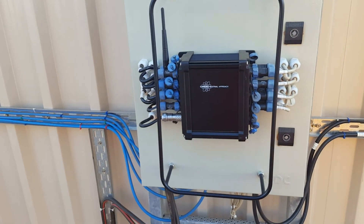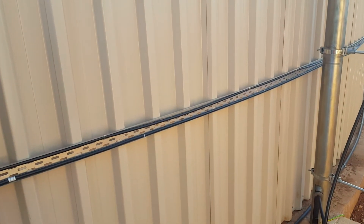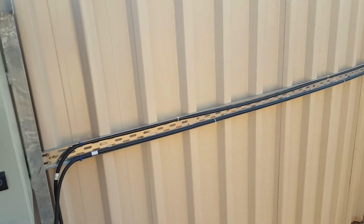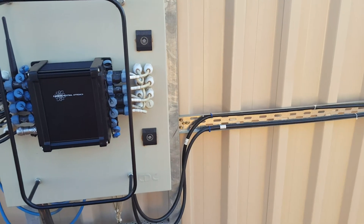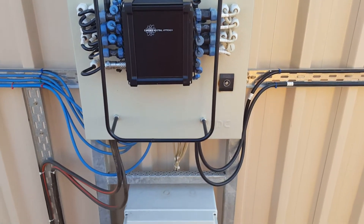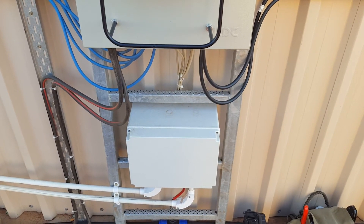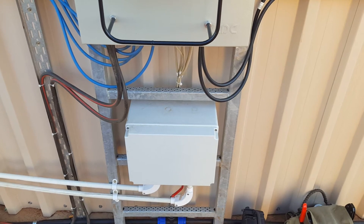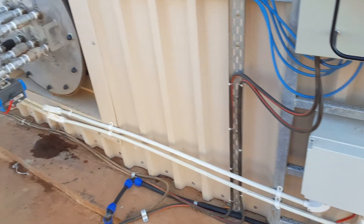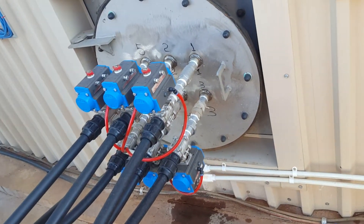Other work that the piglet does via those two cables going that side: there's another temperature sensor on the other side of the digester, as well as a pressure sensor that we can use to measure the level of the digester. The relays from the piglet also speak to solenoid valve coils that are situated inside that box over there, and that activates these valves over here.